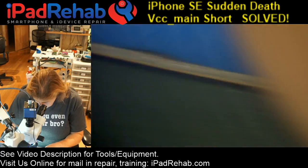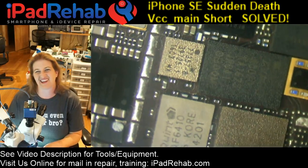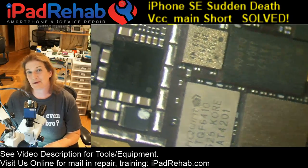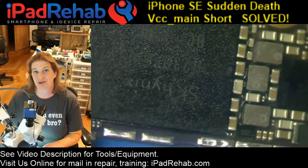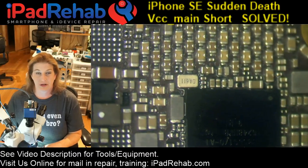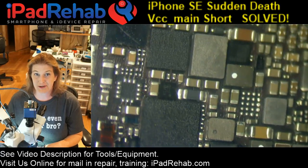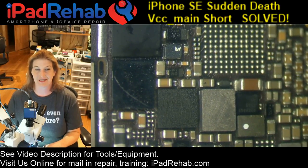All right, so back to my phone. I learned that I did not have a short on any of the kind of intelligent, thoughtful places that I could think of. How would a phone come to have a VCC main short in the absence of any kind of liquid damage, and there's no real history of a strong drop and nothing's getting hot? What are you gonna do? Just start at the top of the board and denude the whole thing?